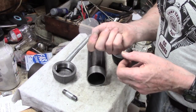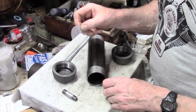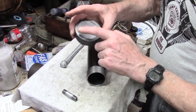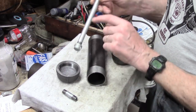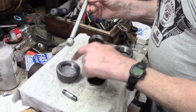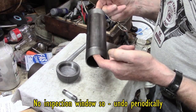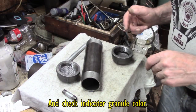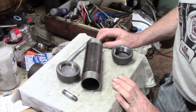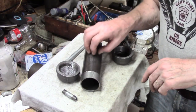The screen is not in itself enough to stop the granules. The plan is to use that plus some canvas-type material my wife dug out, which won't give too much air resistance. We'll have that in each end, and also wrap the whole thing completely with the fabric and screen. Then fill it three-quarter full of granules and put it in line. It'll probably be adequate for the plasma cutter at 65–70 psi, flow rate not too huge. For the blast cabinet it may give too much resistance, but that's the plan.